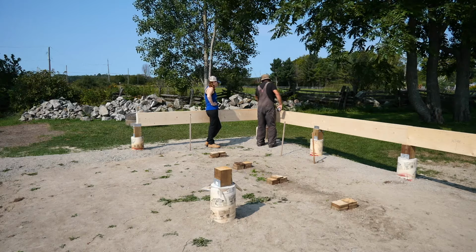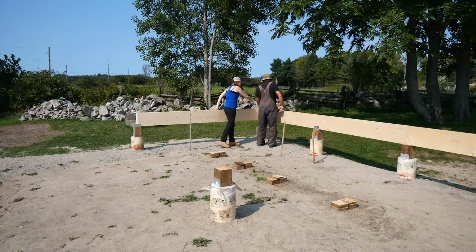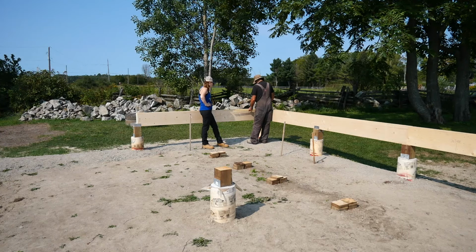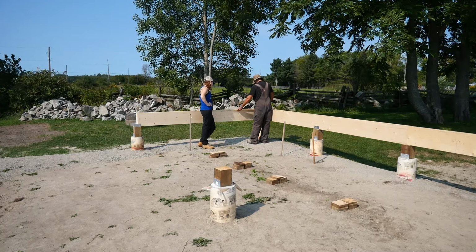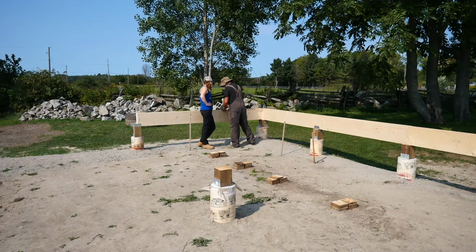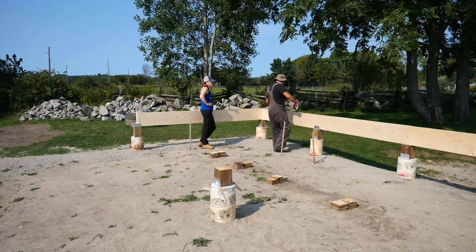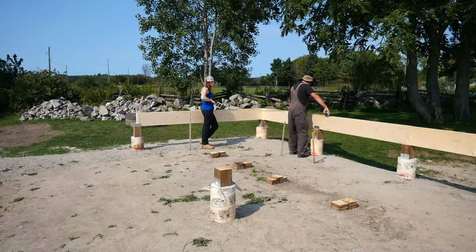Because you just want enough room to be able to set things like shampoo and soap, you know what I mean? So then you add a foot to the regular dimension. You're saying the average tub is 32 inches, add 12 inches to that, that's 44 inches. So that puts our tub ending there, and that's with a surround all the way around it. And if the average tub is about 5 feet long, and we're adding another foot to that, which is still less than this. But we'll leave that.